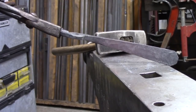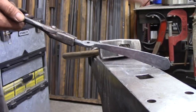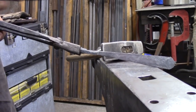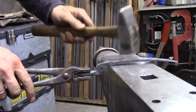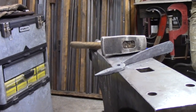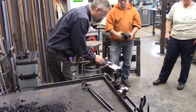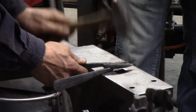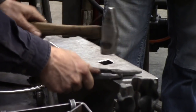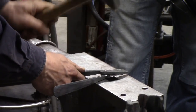It may have to change here and here when we pin the two together to get the handle set appropriate, but we know there's going to be a little bit of curvature to them, so you can put a little pre-curve. And then finally make sure to come out a little bit on the top — glancing blows at angles — and make the head before they go to the fire.